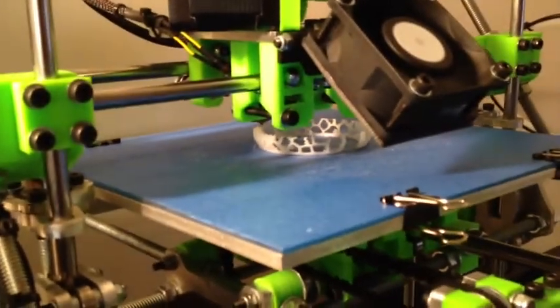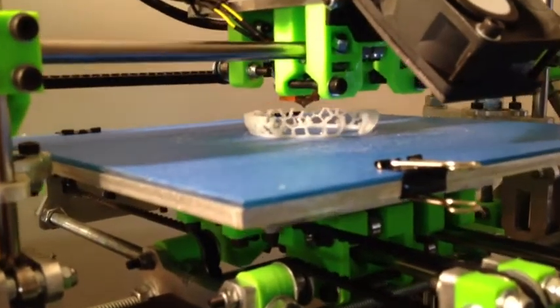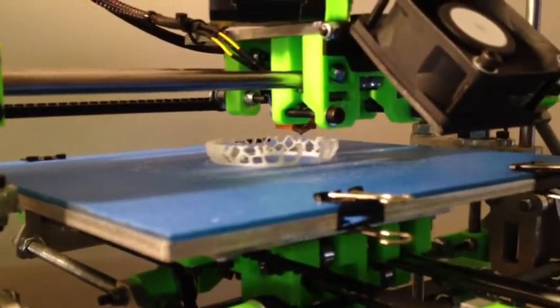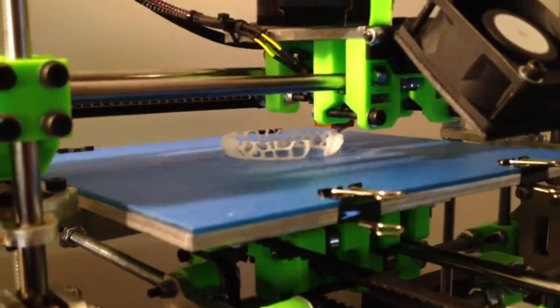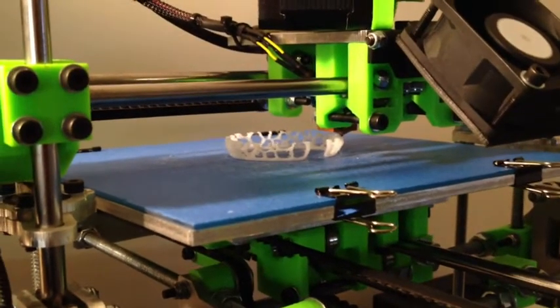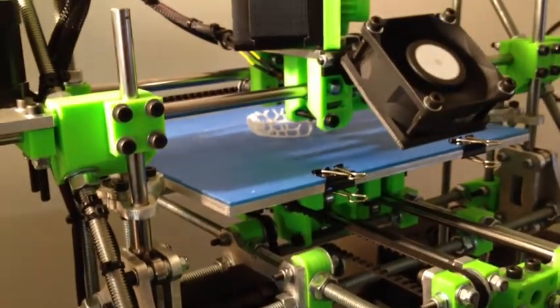This first real challenging build is a little bracelet with a million retracts. I programmed in a 0.5mm nozzle lift before every rapid move, just to keep from smashing any of those little stringers off. It's doing decently well — it still needs a little bit more calibration, but it's printing more than well enough.